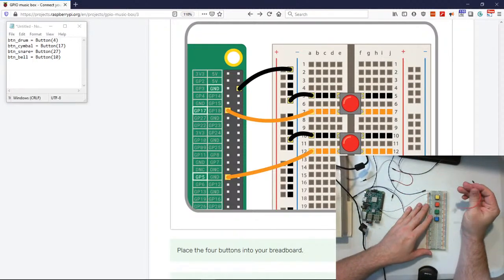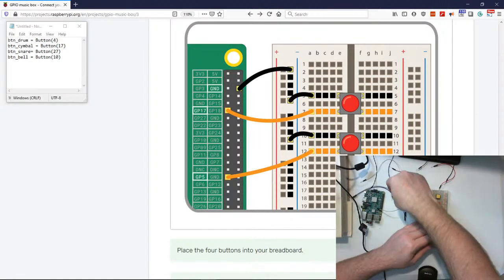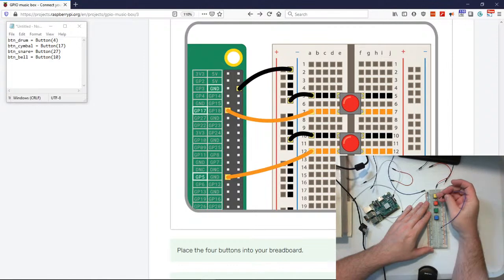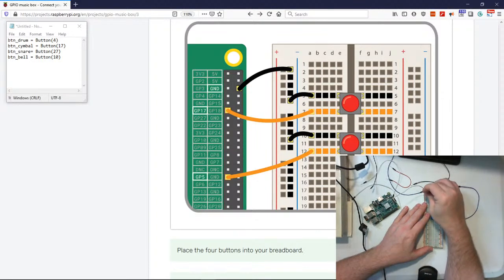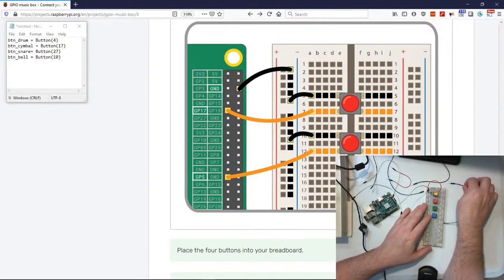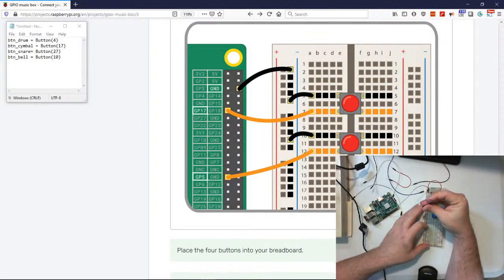But anyway, let's go right through. First, we need our male to female. It actually does not matter which plug you do, but I'm going to follow along with our diagram here. So we'll do the negative first. It has to be on the same row, and then plug that into the negative. I will tell you this with electronics: you work on one small little project and you learn a lot, because it's a big learning curve sometimes.